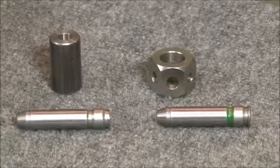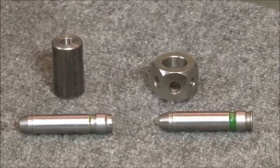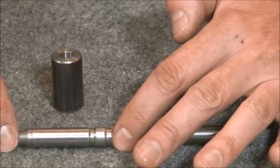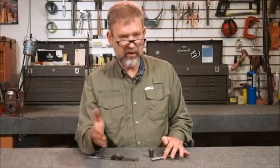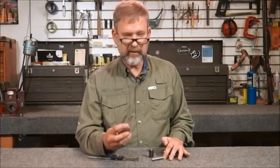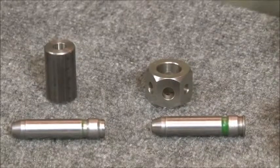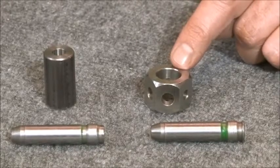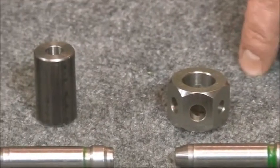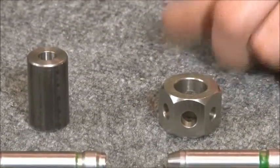Let's take a look at the gauges. They appear pretty much the same in size, length, and shape. The mistake some people make is thinking they would measure headspace from the bolt face to the end of the gauge. For a bottleneck cartridge, we measure headspace to a point along the shoulder called the datum line. The easiest way to measure that is with a ring gauge — something circular that slips down over the angle. I use one of two tools; the first is a bullet comparator, which many reloaders have. I use it because the reamed hole is square, making it perfect for this purpose.